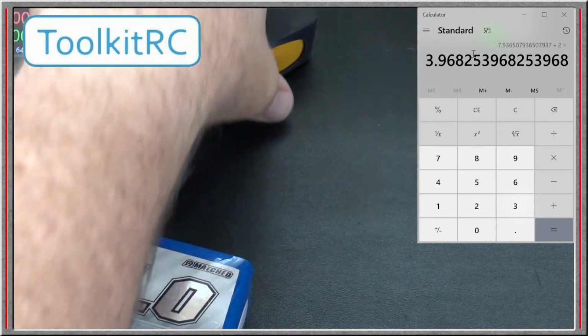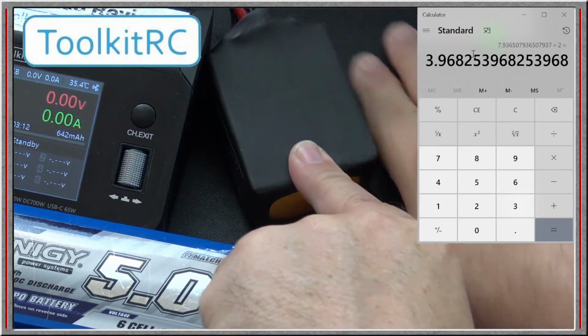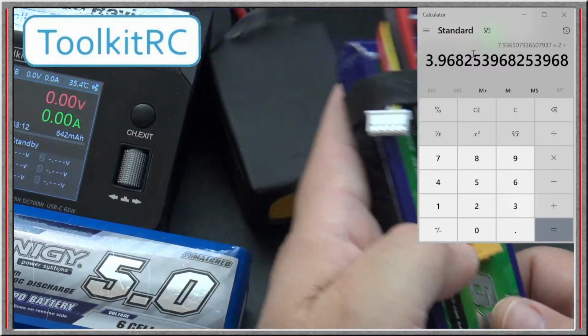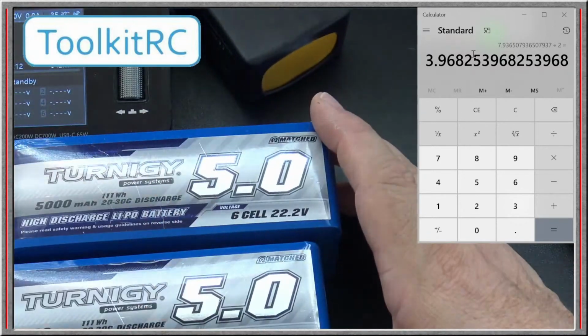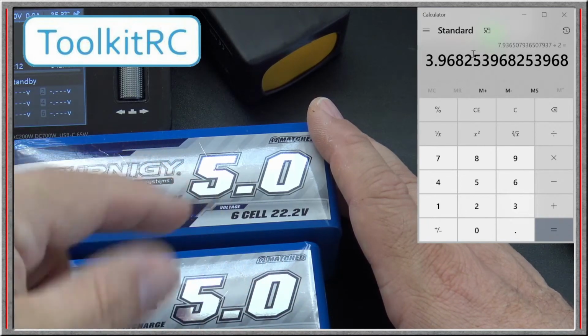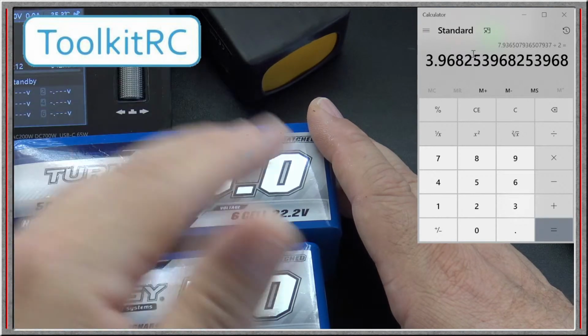So what I'm saying to you is that on the small side at 200 watts, these types of batteries, you'll easily be able to charge these at a full 1C. When you start getting into these big honking things, you're a little bit lower. You're going to be down at 4 amps instead of 5. But that's close. You're like 75% of the charge rate, right?